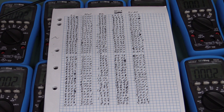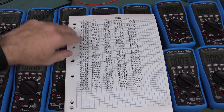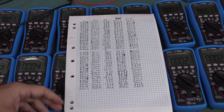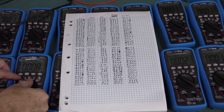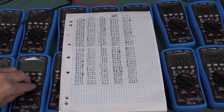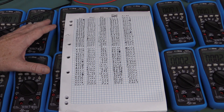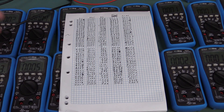I'm actually quite impressed by this, and this is typical of even relatively low-cost meters like this one because they do have software calibration. There's not enough spread in the data to get a huge amount of useful info - all we want is the min-max spread on each range, and you can calculate the percentage. It's much better than the specs. I'm not sure of their exact calibration procedure - some meters have a calibration menu when you hold a button down and turn them on. I believe they may be relying upon the voltage reference inside the chipset and the precision of the resistor networks.